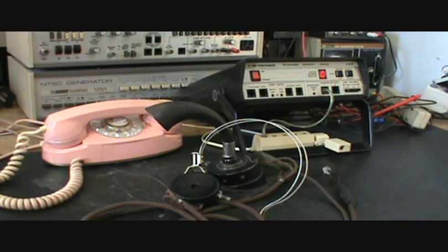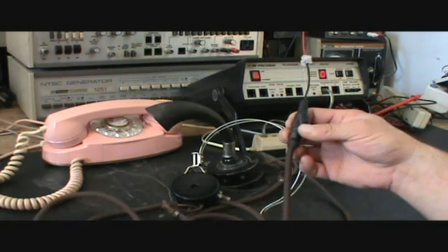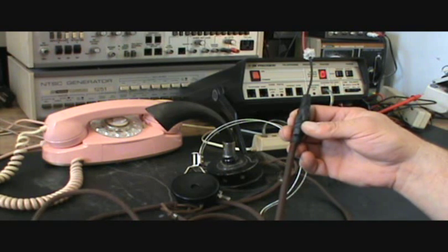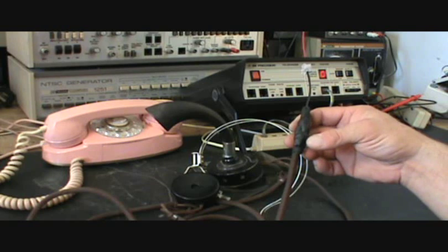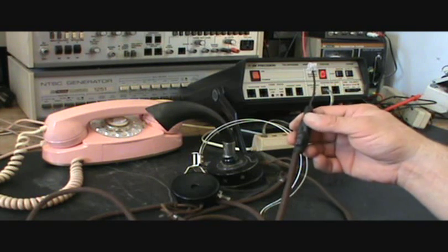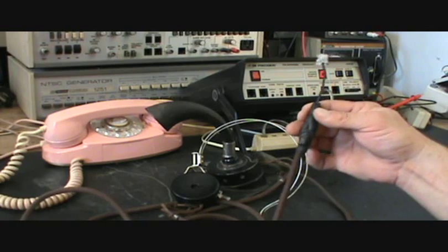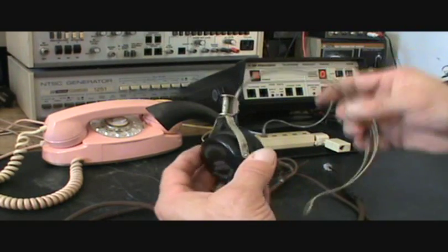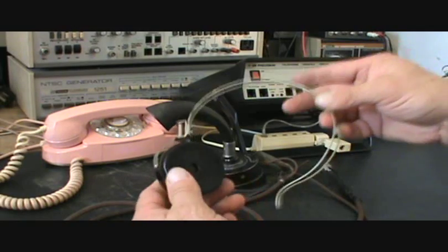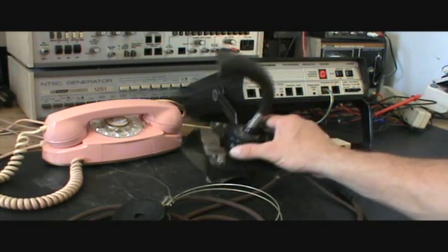We're back now and we have finished up with this operator's horn and headset. Since the line cord is cloth and it's so thick, we would have normally put a modular port plug adapter on, but this time we had to pigtail to it, and it should be fine. We use marine grade heat shrink, so when you heat it up it actually has a glue inside that seals everything. Ken should be just good with that. The receiver capsule and headset have been gone through and taken care of, and the horn has been put back together again.